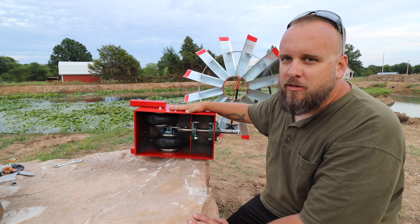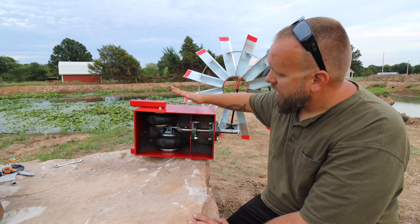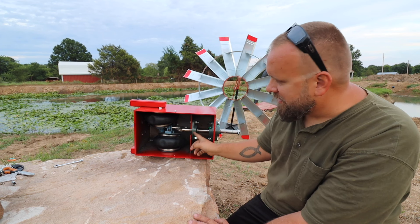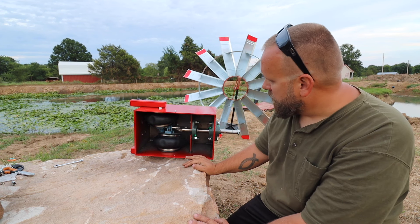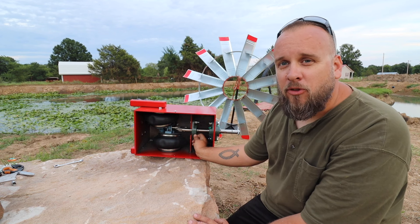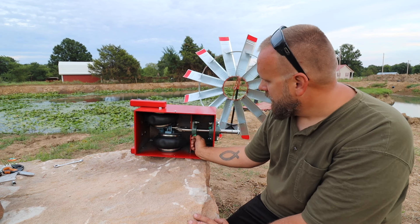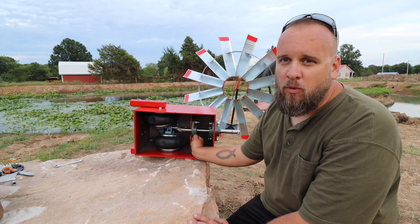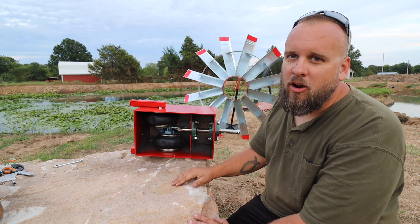So your tower is higher quality, your compressor is higher quality, and the bearings inside the compressor are pre-greased. They don't need greasing for three years, and when they do, it's just one squirt of grease with a handheld gun — you don't want to blow a ton of grease in there with a powered gun.